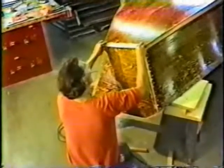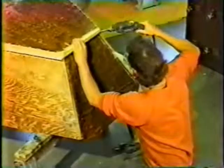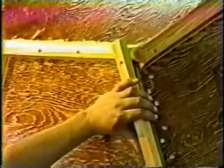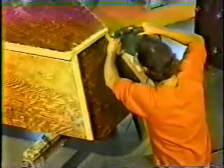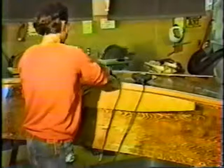Use one and a quarter inch screws to install the front and rear transom pieces. Start with the bottom piece. Use the standard procedure for attachment. Cut the oversized pieces to fit exactly as you go. The cut strip is the easiest of all the pieces to install — adhesive is not necessary. Center the strip on rib number two. Attach it with two screws to each of the three ribs.